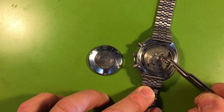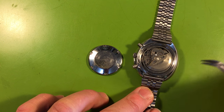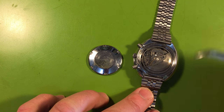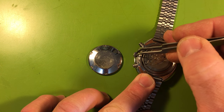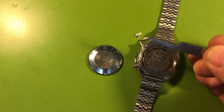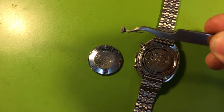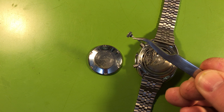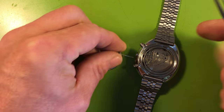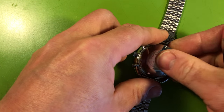The watch doesn't tick at all — I have no idea what I'm going to find when I pull this thing apart. It's also missing parts like the movement ring spring. Obviously I shouldn't be able to do that — I just popped the stem out. You can also see that the crown seal is bad; it's flat. That should be a nice high round donut seal. They didn't even bother putting new seals in it. They just found some old movement and jammed it together.